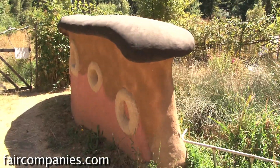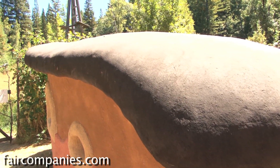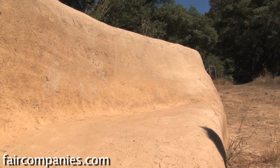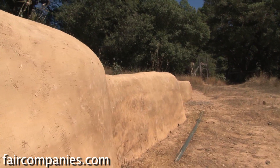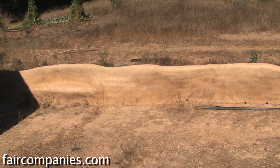So this is just earth. The roof part of it is sealed with linseed oil, which soaks into the earthen plaster and polymerizes and sort of turns into a plastic-like substance. That makes it harder and also much more weather resistant. This retaining wall that you're seeing right here is made out of gravel bags. And then over that, because this is an exterior situation where there's no roof protection, we've used some cement to stabilize the plaster. So that's an earth, sand, cement, and straw plaster. The cement will help the earthen plaster not get soft and erode in the winter rains.